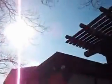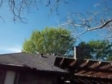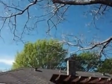Actually, more soffits. We're looking okay from the ventilation. I just want to find out what the ventilation is for that apparatus. Okay, so we've got adequate soffit ventilation all the way around the house, and there's an apparatus vent there, and then on the roof itself we've got two turbine vents. All looks quite good. Our next stage then is to get up on this roof and see what we can see once we're on it.